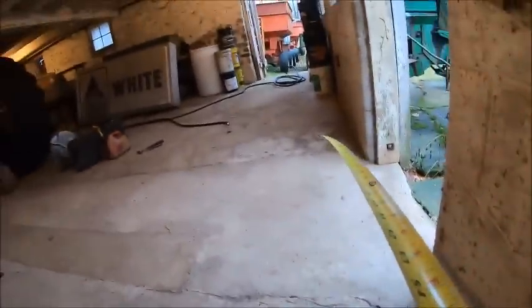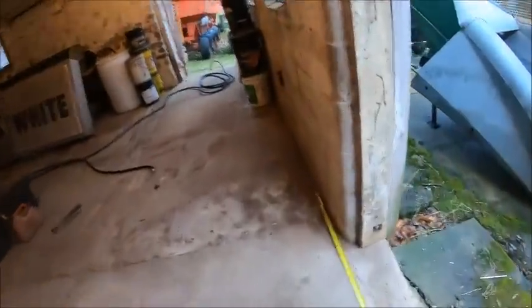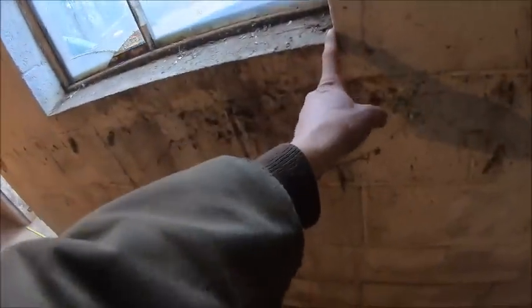A full block in right to here should give me a 158-inch doorway, roughly, 158-inch overall center-to-center on the grout lines, if I remember right. Give me a minute here. Sorry to make you dizzy. So basically 158 and a half grout line, and then the edge of the door will be there and here. So that'll get me a basically 10 and a half foot door, 126 inches.